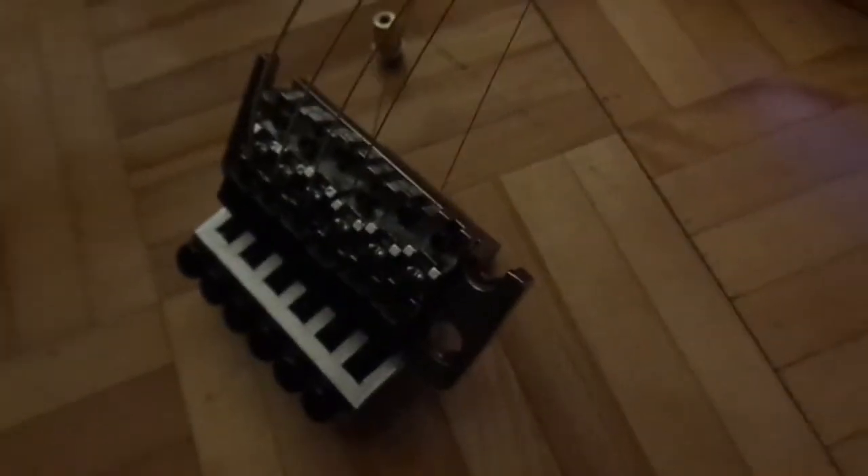This is why it flops around. Let's try screwing it in from the back — we need an Allen key. I got my trusty 3mm Allen key and got the pin out. To tap this out, it's press-fit in this way, so you've got to tap it from the back. I also used a little block of wood to help not ding the metal.